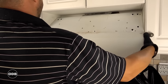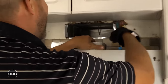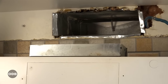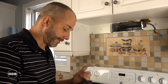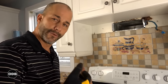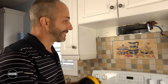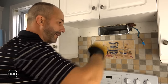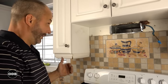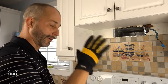There's a damper on the back of these. There's our wire — that's actually in pretty good shape back there. When you're dealing with something like this in your own home as a homeowner in Ontario, you have to check with your own municipality or county, but you are allowed to handle your own electricity in your home — whether or not that's a good idea depends on you. But in this case, because we couldn't even short the breaker out to identify it, I have a lot of serious questions about how this is wired. So we're calling an electrician because this isn't my house and we're not exactly sure what's going on.